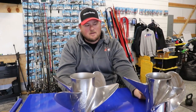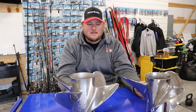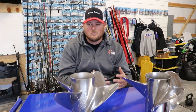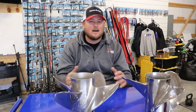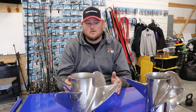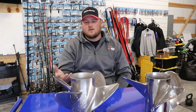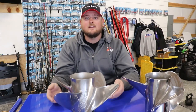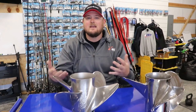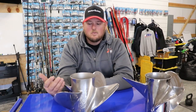Mercury came out with the 3-blade and ran with it for many years. Then they recognized that bass boats were getting heavier and heavier — those 21- and 22-foot rigs had a lot of weight with added electronics, power poles, and that sort of thing. That created an issue for top-end speed because obviously the heavier your boat, the more drag you experience. So they wanted to offer a prop in the Fury line that created more lift — one that could lift your hull out of the water even with a heavy load and maintain good top-end speed. That's the Fury 4.